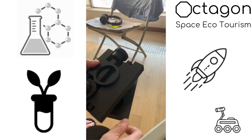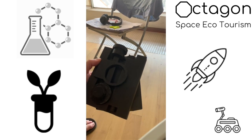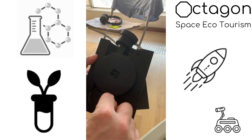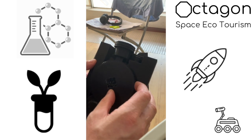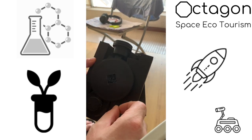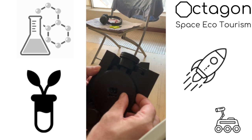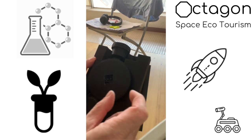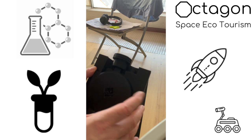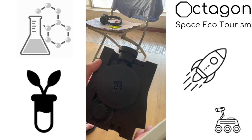And if I want to look at what I'm using as an axle, you can see that this overall wheel here actually sits in here. I get very good contact with the gears now that they're a lot bigger than the internal workings of the quick release. I have been able to get these to skip very specifically when I have the seal. But you can hear here I got a little bit of tolerance, a little bit of play, using my typical 0.4 millimeters on either side. So all the diameters are 0.8 millimeters bigger to create these tolerances. Might have to tighten that up eventually, but putting something together right now seems to be good enough.